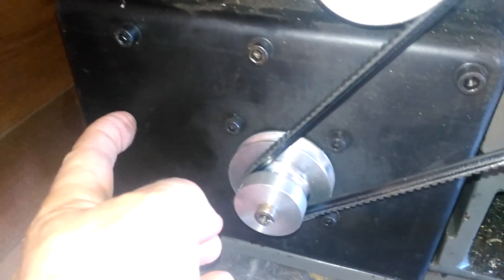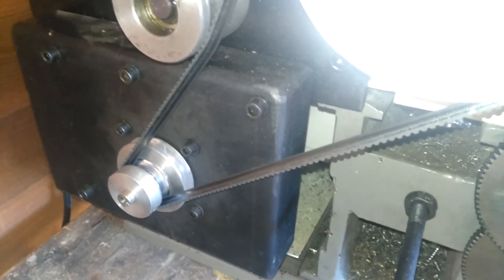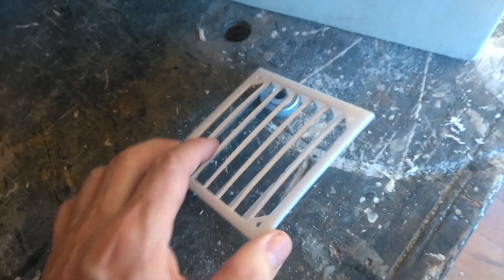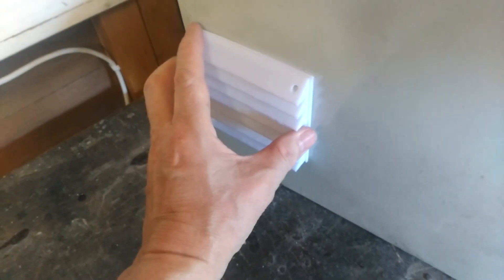What I'm planning to do is fit a fan. I've cut a hole here to put a computer fan, which will blow against this plate, which is in good thermal contact with the motor. The hope is that it will alleviate the problem somewhat. I may take extra measures as time goes on. Into this hole — or onto the back of this hole — I'll fit this fan. Actually, it'll go the other way round. And then onto the front of that hole, I'll fit this, which is a 3D printed grill panel, and that'll fit like this on there.